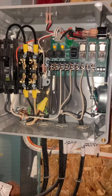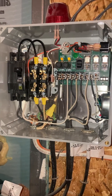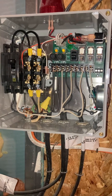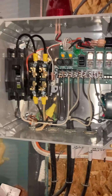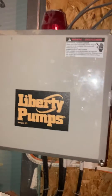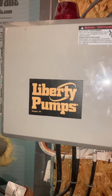Had I known that, I would have saved a day of running to another place to use the restroom. Could have been using our sewage pump this whole time manually — so that's a great little feature. I called Liberty Pumps today and they never told me anything about it, and I really would have loved to have known that. So if your sewage pump is not working and it is the floats that are faulty, you can use that hand switch to turn it on.